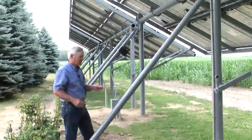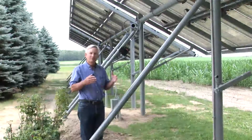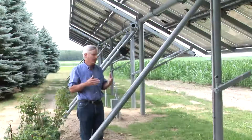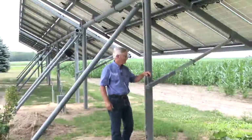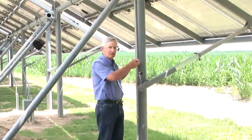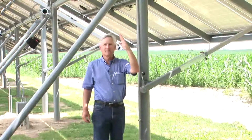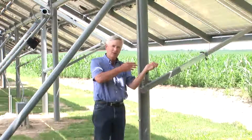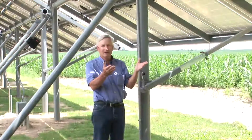One of the reasons for the ground mount system is to make sure that we can adjust it. It's not on a roof that we can't clear snow off of it in the wintertime, and in the wintertime, if you follow me, you can see that there's a jack handle right here. I can take this jack and loosen up the pins on each end and lower this jack down and tip the angle of these panels almost vertical in the winter because the sun is way in the south at the wintertime. During the summertime, they're close to being flat like they are right now.